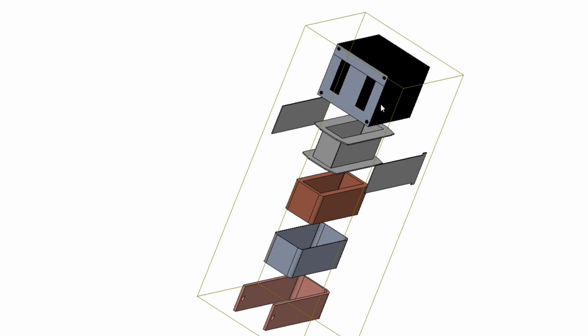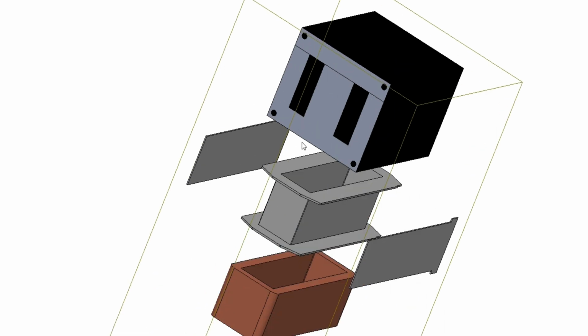Eddy current losses are constant, and the fraction of the primary current that is due to the cause of it is known as the magnetizing current. The resistive losses in the windings due to the current flowing is generally known as the copper loss, and is proportionate to the percentage of the full load that the device is run at. We want to keep this minimum on the cables running to the clamp, so the bigger the cables that go into the clamp, the better. The laminations are sprayed with lacquer for insulation purposes and reduces eddy currents. So these are all coated in a lacquer.